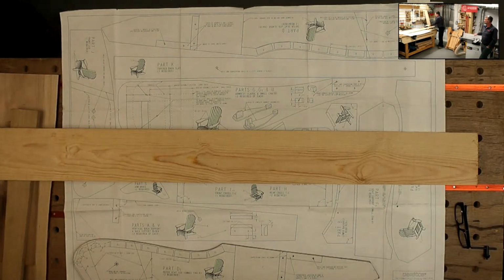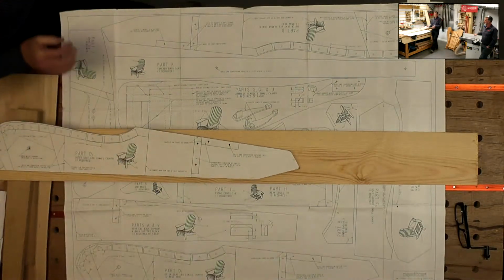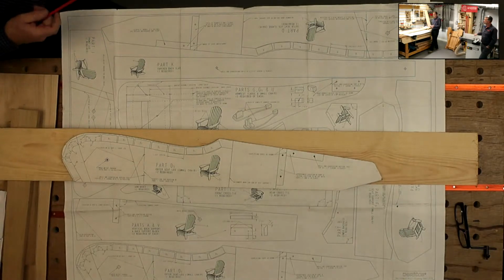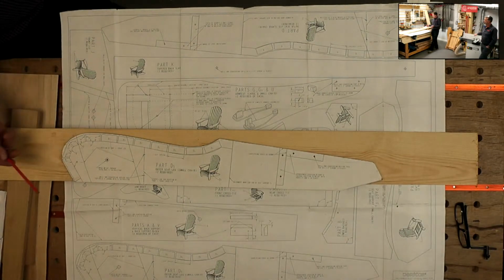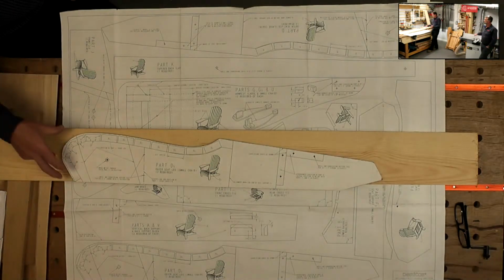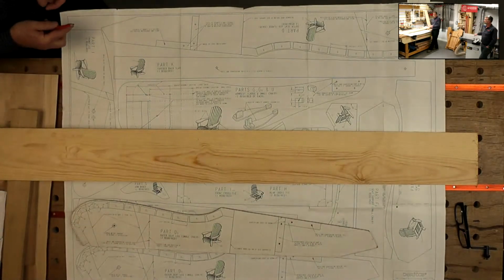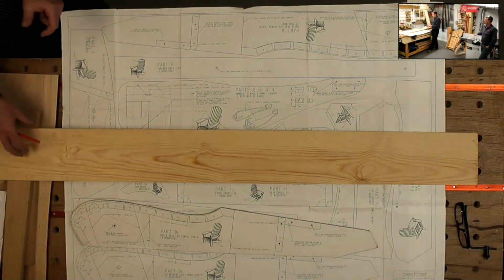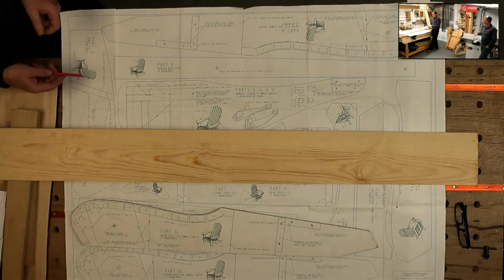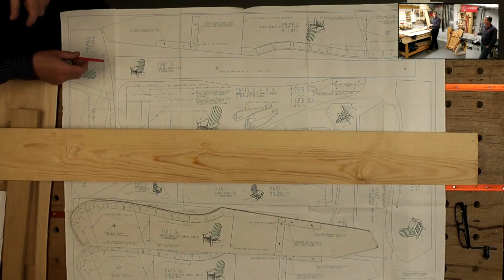As we already said, now we have some redwood. We've done some of the machining just to cut the time right down. Our aim today really is to start going through some of the machining, getting some of the components out. The major component for the base unit is this side rail. All right, so we've got to have 2 of those. We're going to go through how we're going to make it and a few tricks and things we've done over the time. So when we come to machine this, want to get it flat, quite accurate. Again, if you're going to buy this in a store, have a look at it, make sure it's not too twisted, it's flat, got something that's going to work nicely.